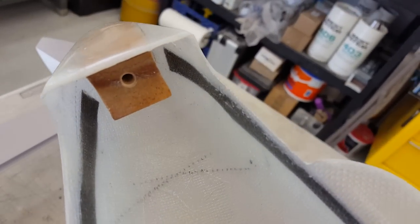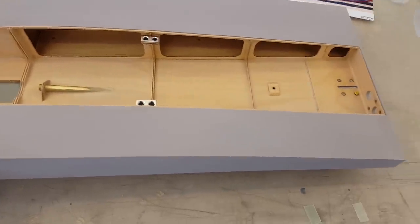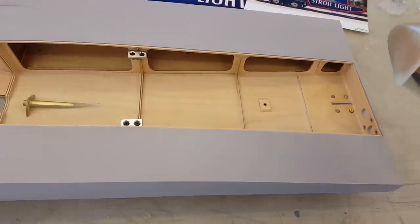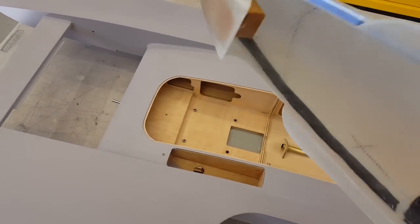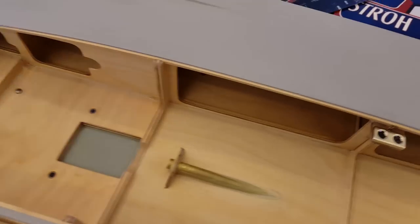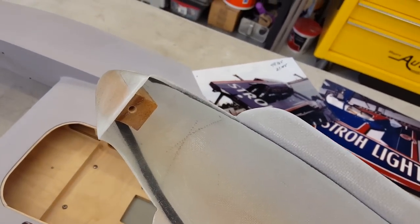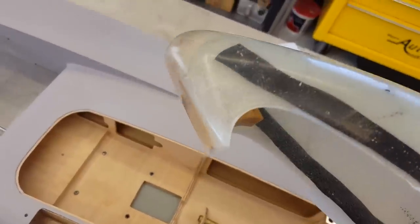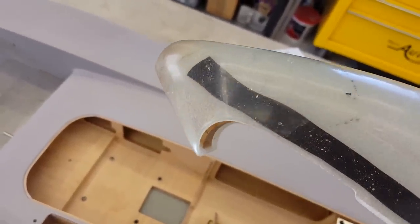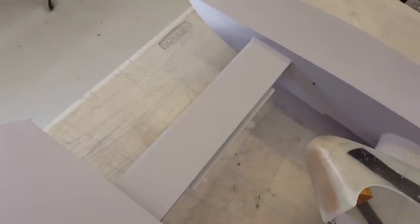The front pin — I got really lazy. I'm crazy weight-conscious; I put a big old block in there. I go nuts trying to make the boat as light as I can. Epoxy is like the biggest weight killer — if you're sloppy about how you put a boat together, all that excess epoxy adds up. I make real fine fillets and that kind of stuff, but then I build the cowling and just throw in a big old chunk of wood. Stupid, but I did it because it was really fast and easy — and I guess I was kidding myself thinking it adds support if I hit something.